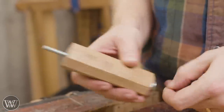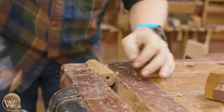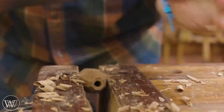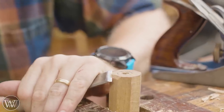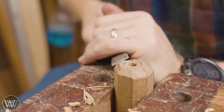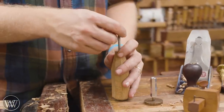Now we've got a bolt running all the way through this — a long quarter-inch carriage bolt that fits in and houses nicely. I'm going to plane down one square side down to a circle drawn around the hole, rotate it and do it as a square, tapering four sides down to that ring, then rotate again and do the other four sides — giving me a nice even octagon. For the butt end, I'm going to use a chisel, chamfering the edges fairly heavily on all eight sides. That gives you a nice octagonal angled look. Then file down the edges and make anything that isn't smooth nice and smooth.